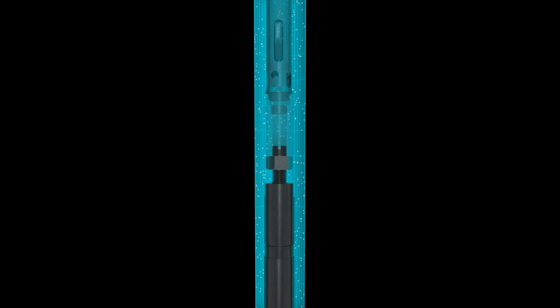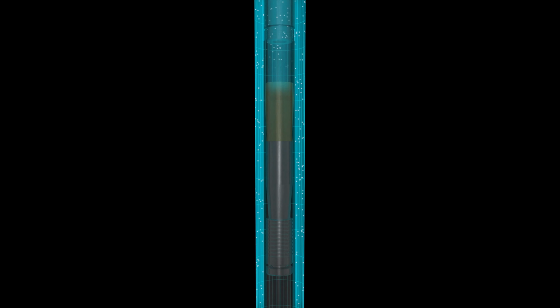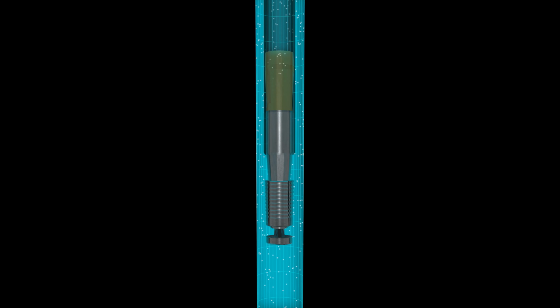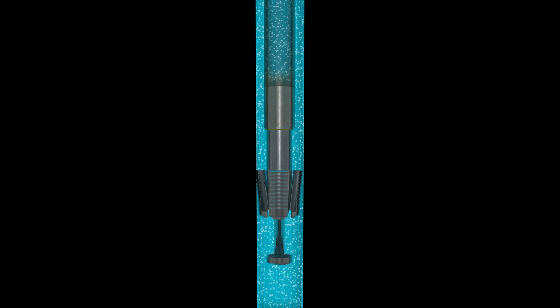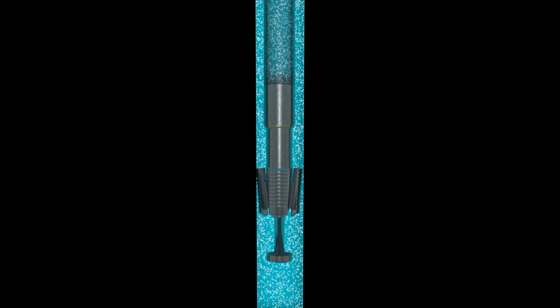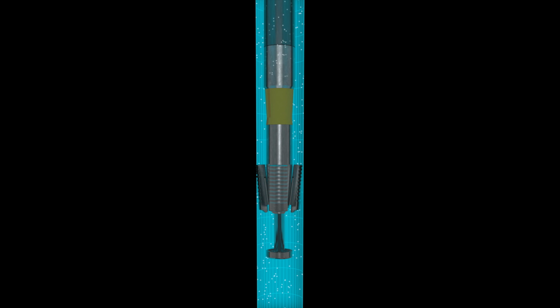At this point, the water will be directed through the inside of the inner tube, pushing the TTB plug out through the bit. Once the plug has been deployed, there will be a steady rise in water pressure. Turn off the pump at this point, but do not release the pressure through the blow-off. With the pump shut off, slowly pull back the rod string until it is clear of the TTB plug, confirmed by a release of pressure on the water pressure gauge.